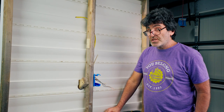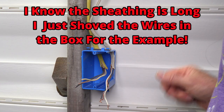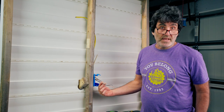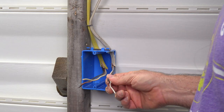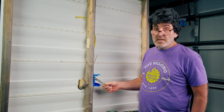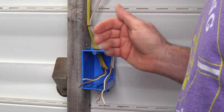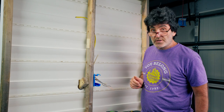Tip number six is another potentially dangerous situation — using the wrong size wire for the wrong size breaker. Say you have a number 12 wire coming in from a 20-amp breaker at the fuse panel. The problem is, if you don't have enough 12-gauge wire to run to the next plug and you use 14-gauge instead, that 14-gauge wire is only rated for 15 amps — a problem on a 20-amp breaker. Don't do this. If an inspector sees it, he'll fail you. Keep the wire the same gauge. However, if the opposite were true — a 15-amp breaker with number 12 wire — that's fine, since number 12 is rated for 20 amps.